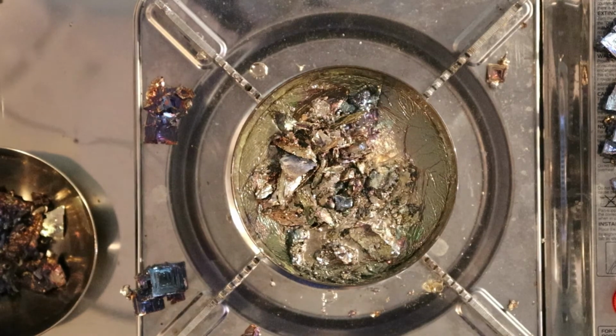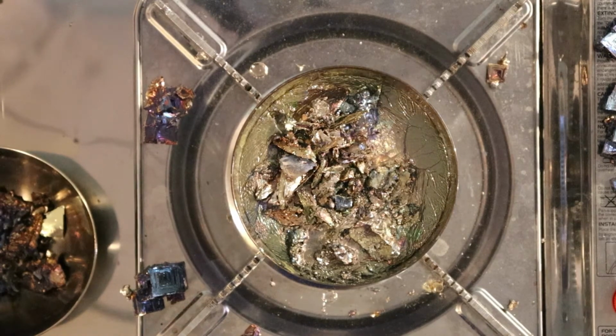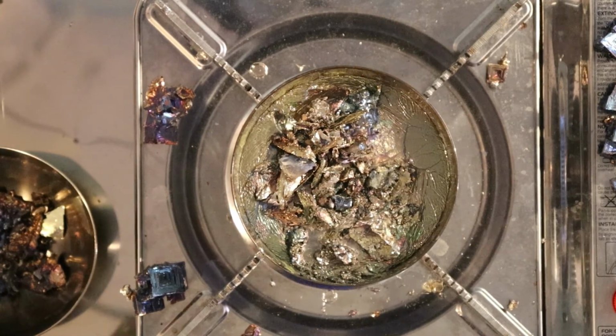Oh, I'm asking myself, why use a spherical bowl versus a flat bottom? I think that's a pretty good question, too. I probably should try a flat bottom. I think the idea is that it's maybe a little more efficient to heat a spherical bowl. It has a larger surface area to volume ratio. So if the heat of the flames goes right up the sides, I get a pretty good heat transfer from the gas flame into the bowl. But that's really not my chief concern, and that would probably still happen if I had a flat bottom bowl.